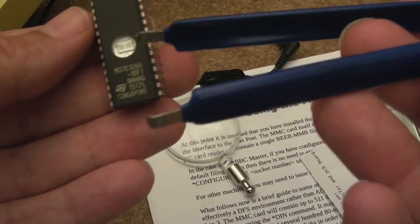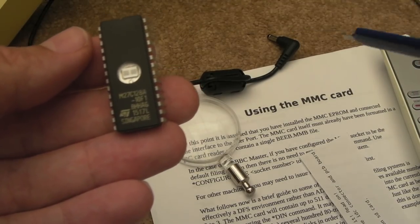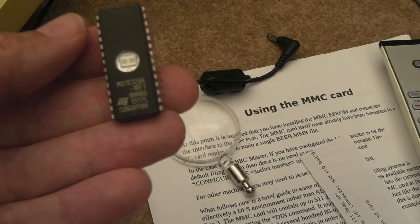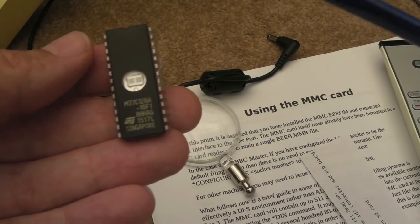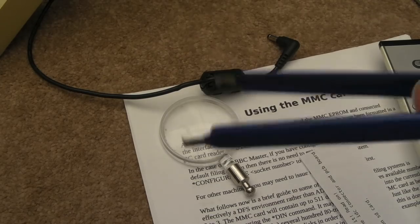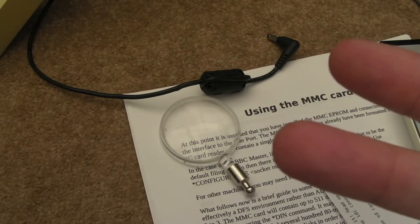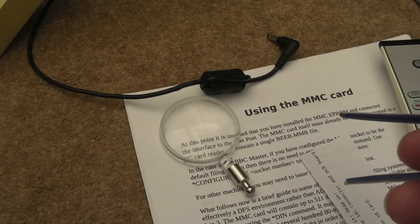But following that, it then led me to think, I wonder if those Rockwell CPUs I've got are fakes as well. Now, you remember, I think it was part one, I said that it killed my Rockwell 6502A. And I had that chip just sat on the side, ready to do some tests on it at some point to work out how it had failed, what had gone wrong with it. I think it was outputting all highs or something. It was acting very strangely. But anyway, I had that on the side there to test. And yesterday, I connected it up to the VIC-20, and it worked perfectly. I had another one that I just tested the day before in the BBC, and that wouldn't work either. So I had two of those Rockwell 6502As, and I tested that in the VIC-20, and that worked fine as well. Putting it on test there for a good hour, no issues at all, rock solid.